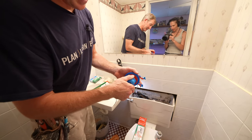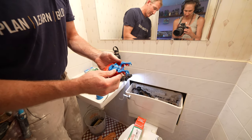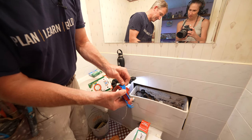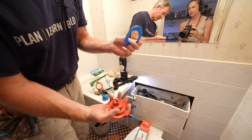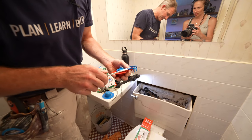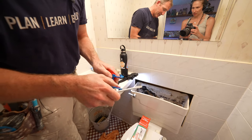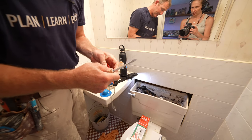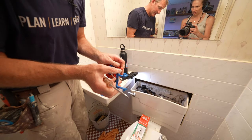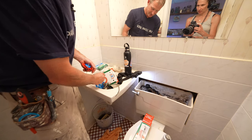Essentially, all you do is take all the blue off. This big bulb comes off the bottom. We also take off the rubber gasket that's blue — that's for the three inch, we don't need that. And then we also take off the little connector point for the hinge for the flapper. These just kind of pry off. So all three of these you just remove and discard.